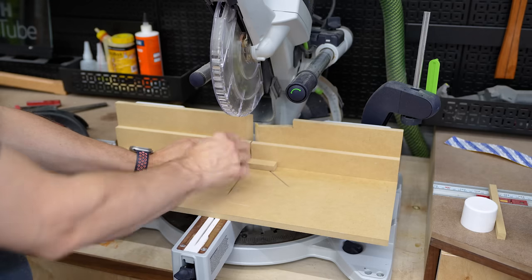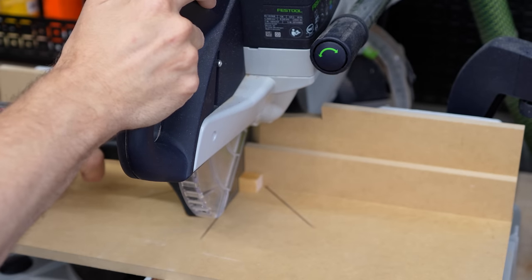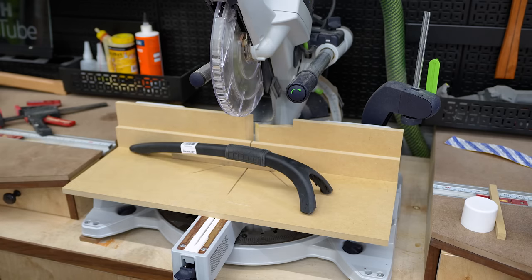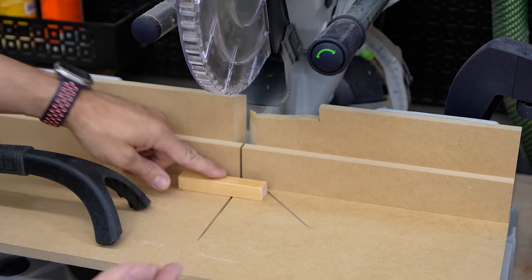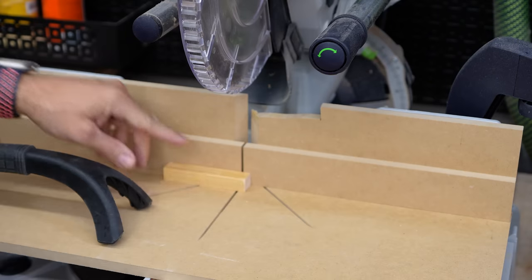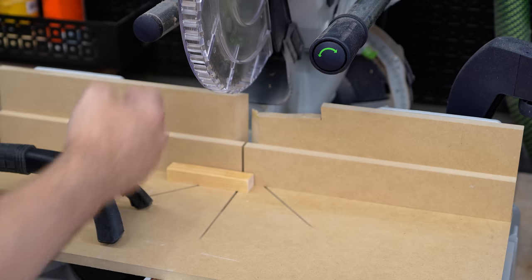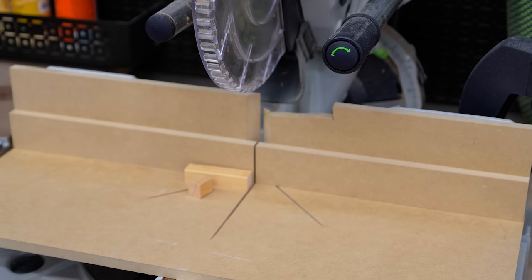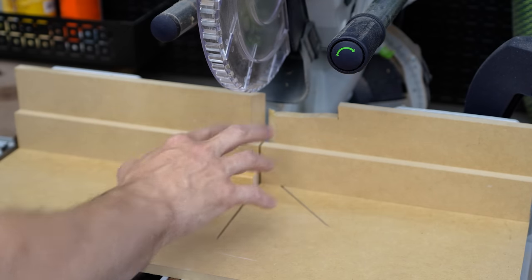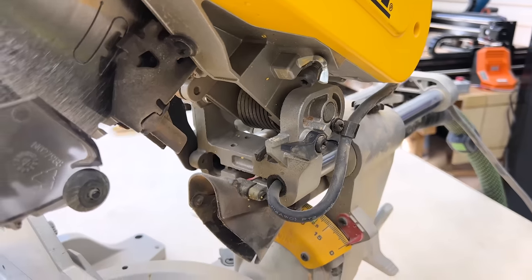It gives you a much cleaner cut because of zero clearance on the bottom and back. More importantly, it's much safer for cutting very small parts. Just make sure you use something to hold those small parts — I use a $10 million stick from FastCap, I'll link it in the description. Cutting extremely small parts on a miter saw can be very dangerous because most fences provide no support. This miter sled gives you full support on the bottom and back so parts don't twist and get pulled into the saw causing kickback or injury. If you only do 90-degree cuts, skip the 45-degree notches and you won't need the secondary fence. Just remember to set your blade depth so you don't cut all the way through.